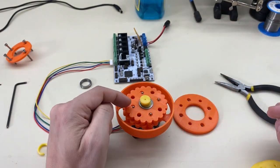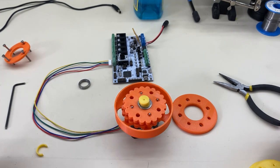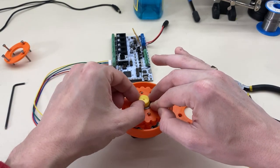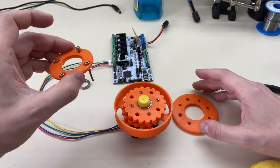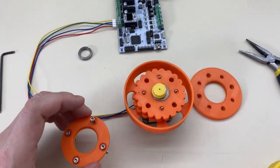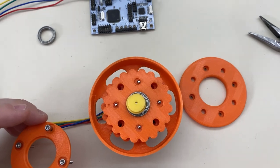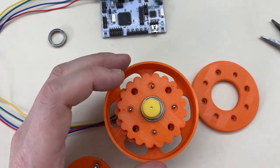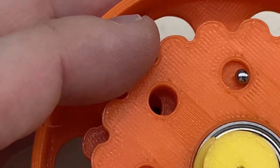I'm making sure that I can see both dots, because one dot is visible through the gap of the gear above it. Now time for another clip. Excellent. Let's take a look here — can we see through these holes all the way down? Yeah, we have to be able to see right through into the gap in the bottom there. That's good.